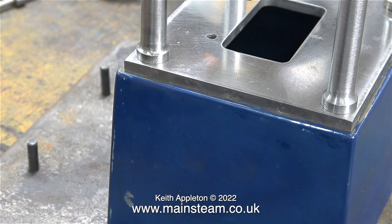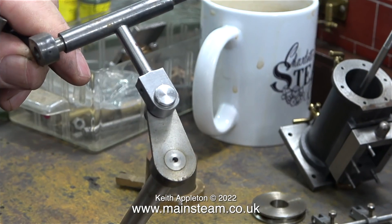What I'm going to do is partially assemble the engine to see how many parts are damaged, how many are incomplete, and how many are missing altogether. Here are the parts for the connecting rod, which is quite special on these engines, but the centre peg is not a good fit in the hole, and the hole in the crossbar hasn't been counterbored to accept the shaft. I would have to check the drawing's dimensions to make sure that counterboring it didn't change the geometry of the connecting rod.